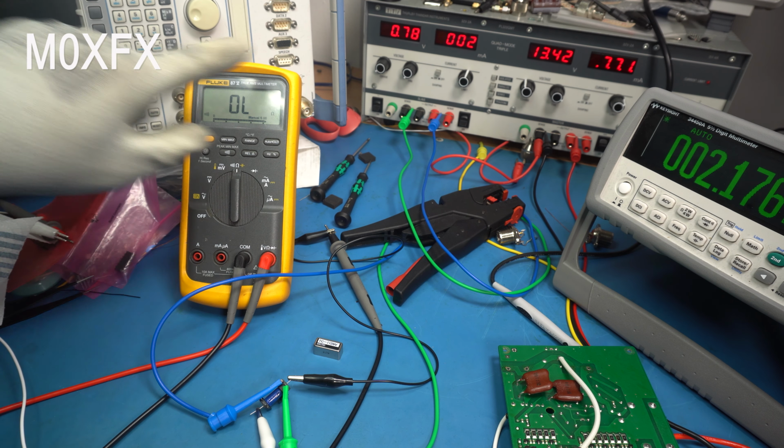So we were getting 1.4 on the original with that Toshiba switching transistor. We put in a new transistor, and that's taken it down to 0.8. And at 0.8, it's not pulling. So, yeah, it's really interesting. I've never worked on one of these before, but if anybody's got one and they're working on it, it'd be worth just checking what the voltages are. I don't like this. I don't like it at all.